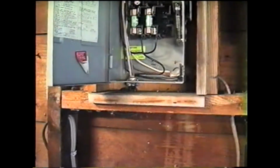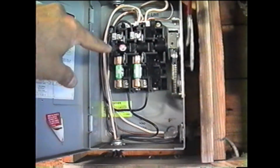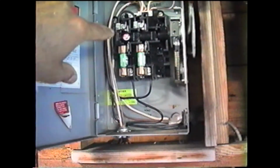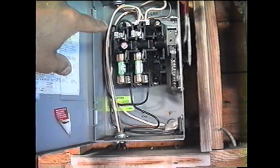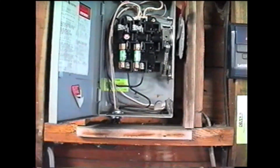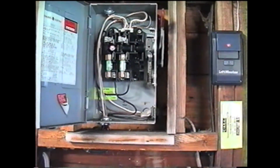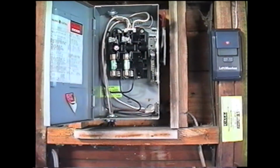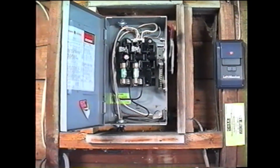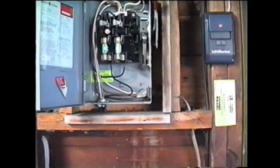You can't see those at this time, but coming back here, what they do with that wire is they bring it up and split the wire in two. There's two fuses here, 20 amp fuses. They break the 30 amp circuit into two other circuits, protected by 20 amp fuses. What I'm going to do is pull the fuse for one of those circuits and try to figure out which lights and outlets are covered in each one of those circuits, and split them up so I can draw a circuit map.